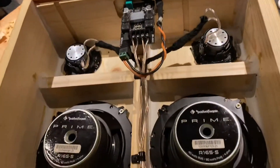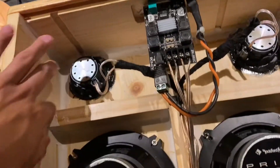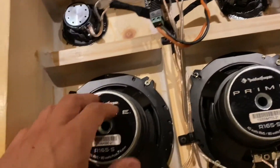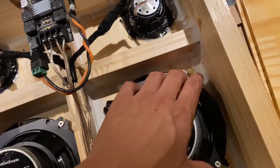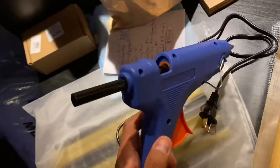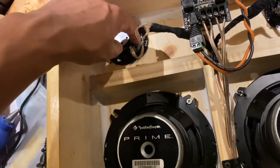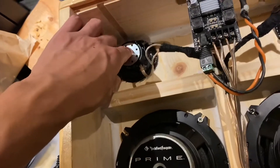We're at this stage now. I put some silicone-based white caulk right here. I set the speakers on some gasket so that it's nice, with screws holding the speakers in place. I used this 100-watt glue gun with high-adhesion glue and put it here to hold the tweeter housing in and set the tweeter in.